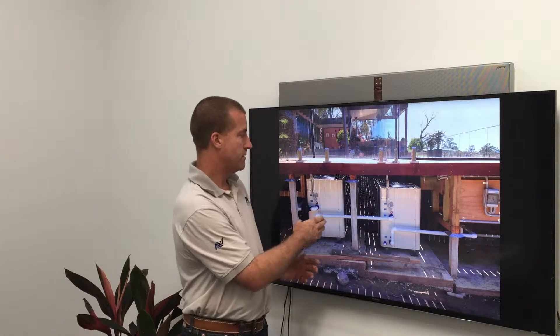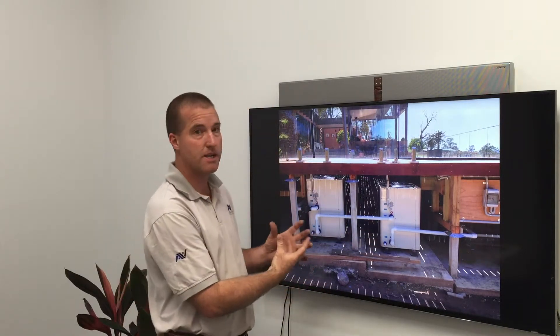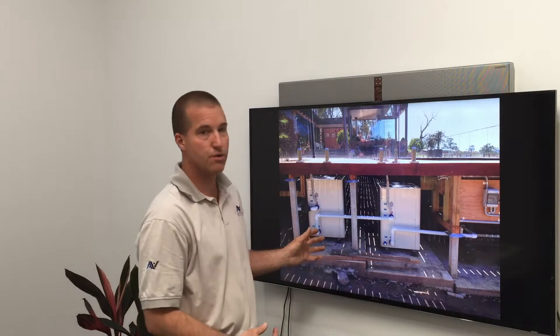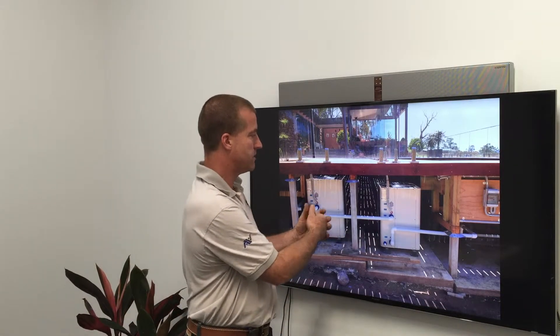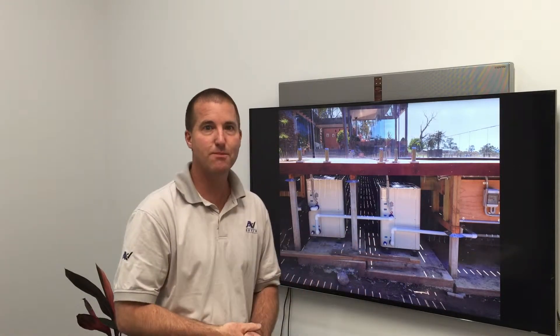What we're doing here is expanding the gas with the air coming through, so the exhaust air out of this would be very cold — just like opening a barbecue gas bottle. We blow air across it and blow that cold air away; we don't want it, it's called waste cool. Then we take that gas and compress it somewhere else, running water past it while we compress it. As we compress it back into a liquid again, it releases an enormous amount of heat, and as we rush the water past it through these pipes, the water gets hot. That's the heat pump.